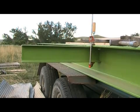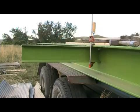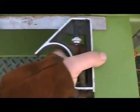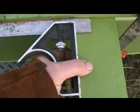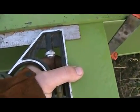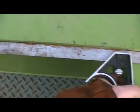You are now able to weld on the outriggers. Place each outrigger where each cross brace runs through the weighbridge. Make sure you have a tight fit against the web of the 10-inch I-beam. Using a sliding C-clamp, tighten the outrigger against the leg of the 10-inch I-beam and make sure it is square. Now you can weld it in place.